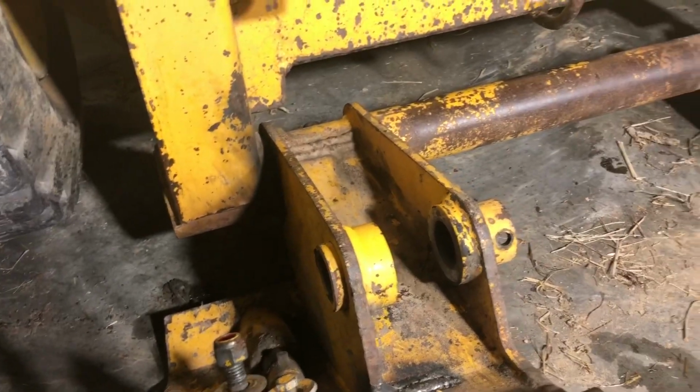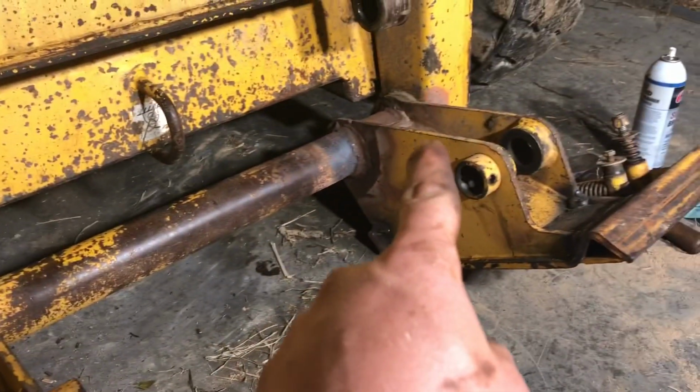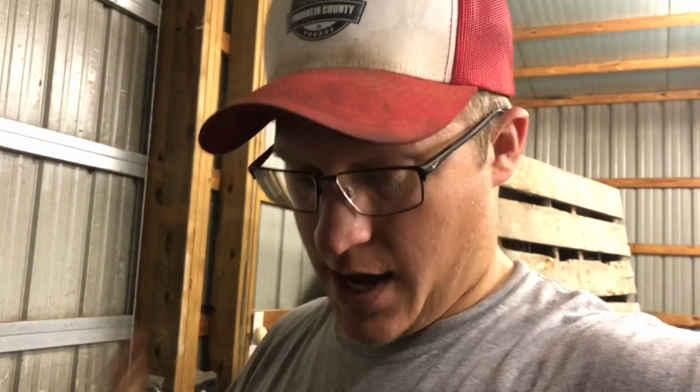All right, guys, we got her pinned up. Just this bolt over here is just slipped in. This one over here is not even in all the way yet. Determined I need 3/16 of an inch worth of shims. I'm gonna go ahead and put the handles back on this quick attach, the attach handles, and I'm waiting on some shim material that I'm having cut.